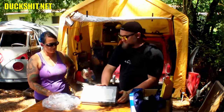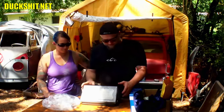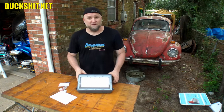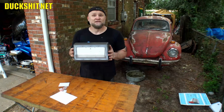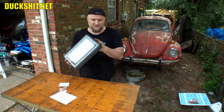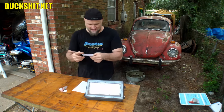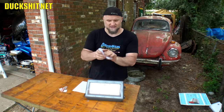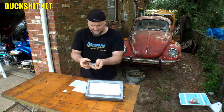So I might stick one on the front, one on the side where I have no lighting, and then I'm thinking I'll put one up here on the garage tent and set that one up as an appliance rather than a fixture. This light is all LEDs. It uses about one amp of power, or about 120 watts, which is about the same amount of power as your PlayStation. Now think about that for a second. Otherwise included in the box, looks like we have an instruction manual, a warranty or service card, and warranty information.